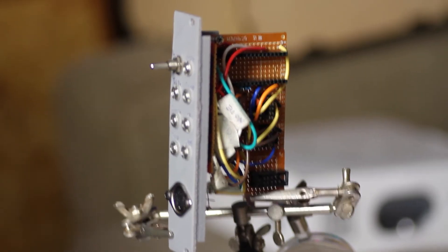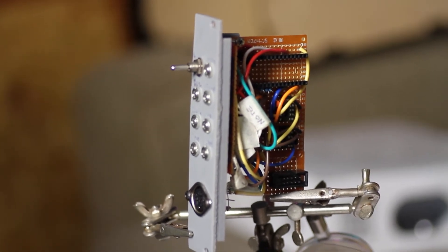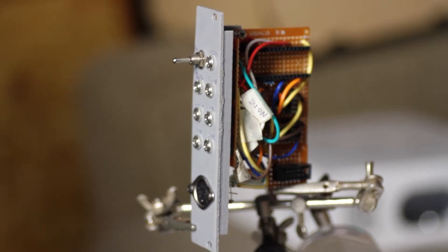From this I had a few problems. It's all on protoboard, which is good for prototyping, but all these little wires I soldered on started to break after a while. They've got bad solder joints, bad wires. I've had them for years and years and they just got brittle. Every time they were flexed I had to pull it apart quite a few times.